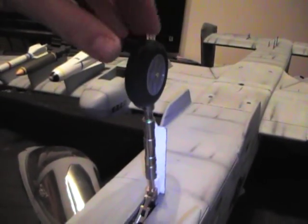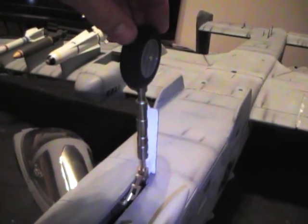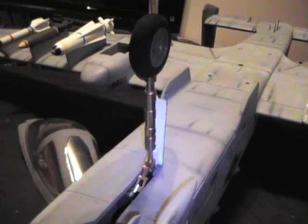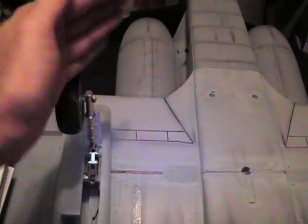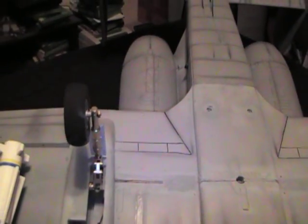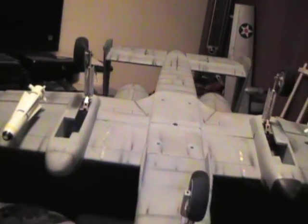As we've all noticed, the steering gear on the LX is a little sloppy, whereas this is absolutely positive. There's no play in the gear whatsoever. Even the RC Lander mod is going to be more positive, just like this one is. With no play in the nose wheel, you won't have the wandering off like we've seen in a couple of other videos. Plus, the other reason for this mod is that now you have the ability to adjust toe-in for better ground tracking on your main wheels, which is also a problem I've noticed on 3 out of 5 LX models that I have here.